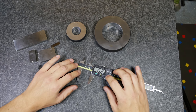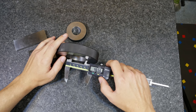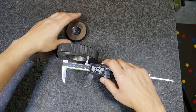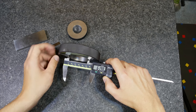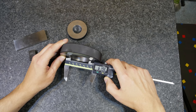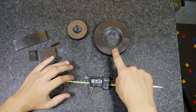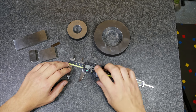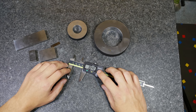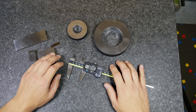I have mostly 27.99 but it sometimes jumps to 28 millimeters, and this ring here has 28.001 millimeters, so the measurement with the caliper is quite accurate. Let's try the bigger ring now. The bigger the diameter, the more difficult it gets, but also very small diameters are difficult. Here I get 61.99 as the highest value I was able to see, and that's the correct one because this ring has 61.996 millimeters. Not that easy to measure an inside diameter, but possible to measure it quite precisely. Of course you cannot measure the roundness of this circle — there are specialized instruments for that — so this is just for a quick check.